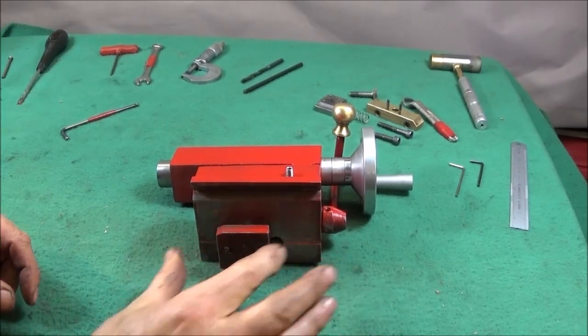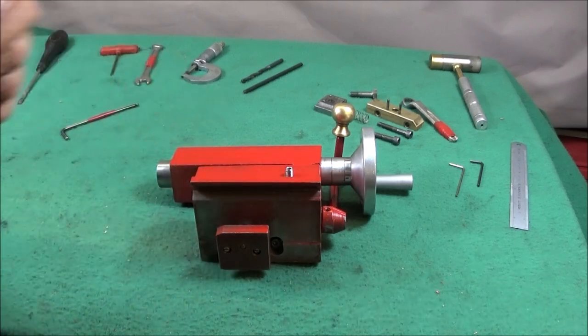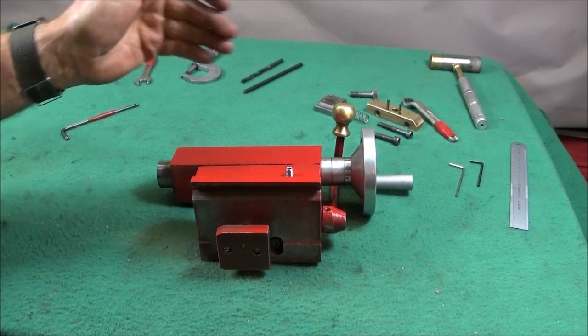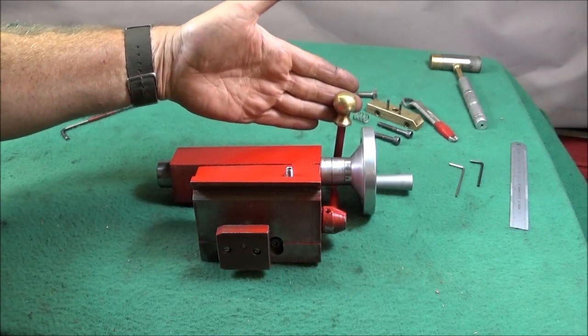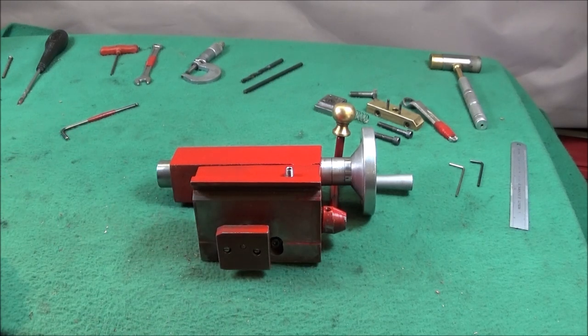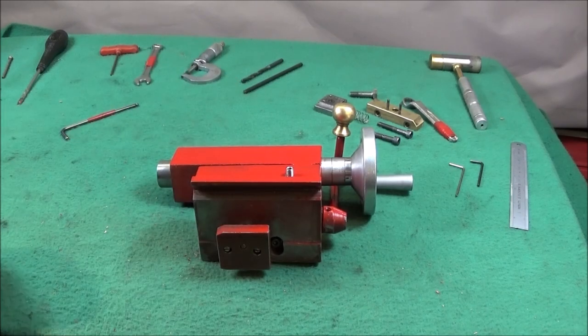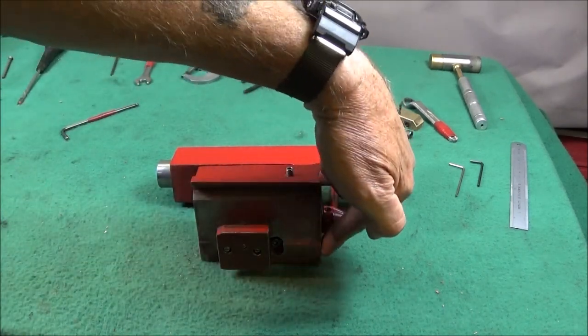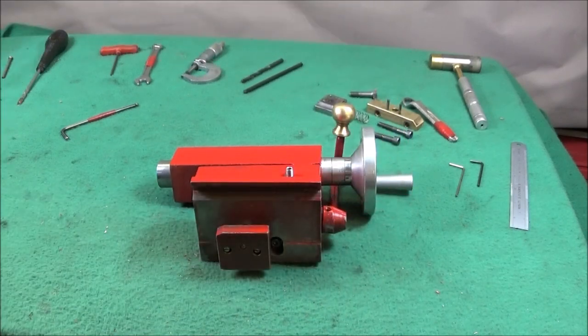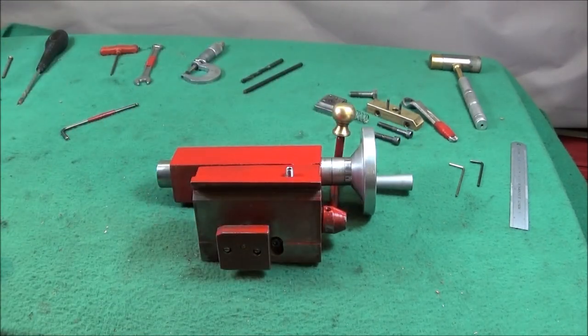Since I've done these changes to the cams inside, the lever operation works brilliantly now and very rarely does the tailstock push back. To prevent all movement on the tailstock, as you've seen, I've made a locking device that goes on the back of the tailstock, and in my next video I'll show you how I made that one and how I fitted it to the lathe.